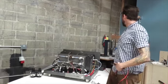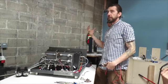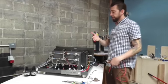Now if you're ever servicing Crucible, taking it on and off, anything like that, where you could be doing anything where the thermistors are involved, that's why we say turn off the machine. Because it's just what I explained.